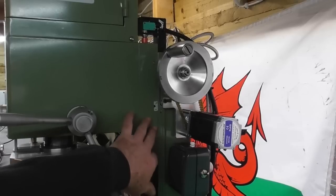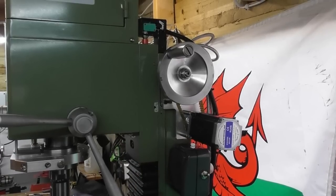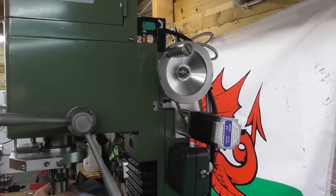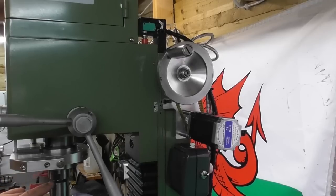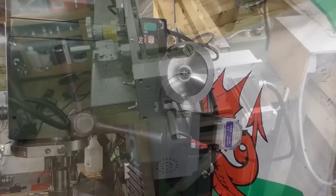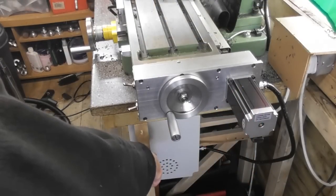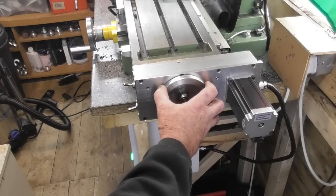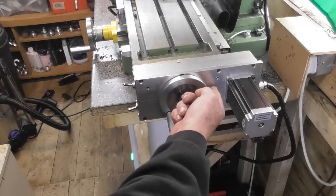I'm going to work on something here — perhaps a block on the side, or a sliding stop — so that I can set a bottom stop. I might have an absolute position where it can't go any lower, but the bottom position depends on what cutter you've got in. I'll probably set it up so that we get about 50mm below the bottom of the quill when the quill is right up, so I can get as much travel as I need. And I'll have a moving stop that'll push on a block similar to the top, so I can adjust it to come to a stop when boring to a depth. I've been asked to put a link up to the enclosure I used, so I'll put a link in the description. And I missed the link to the belts — same gears and same belts for the X and Z axis — so I'll also put a link to the belt size in the description.